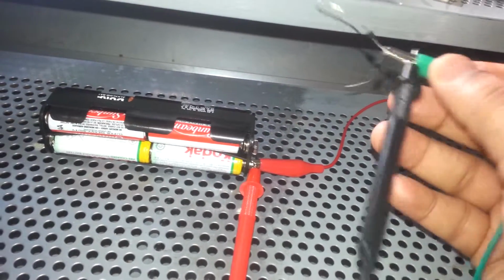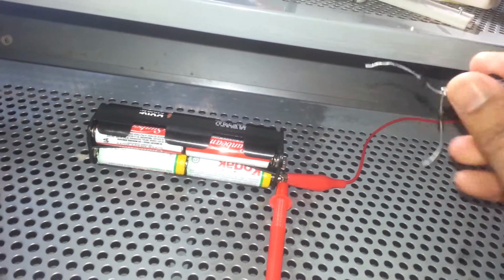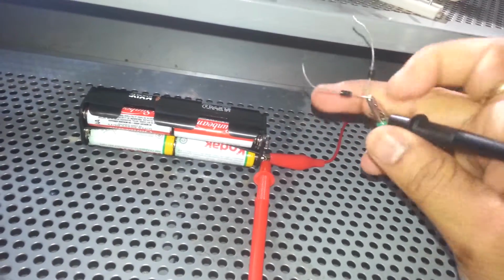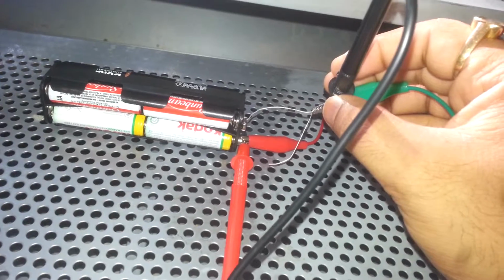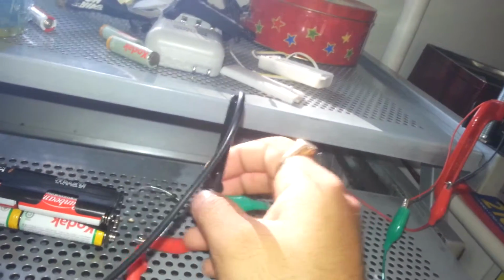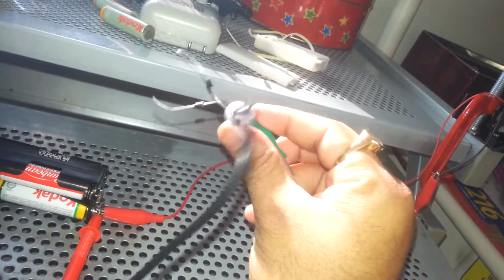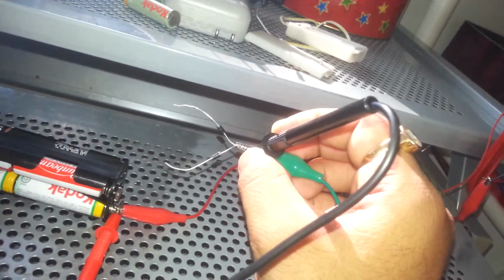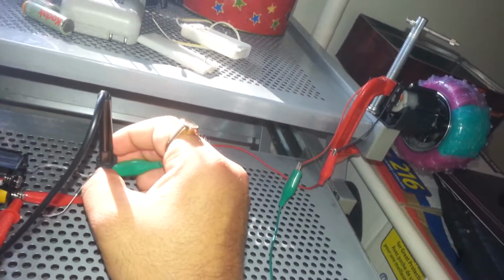So we did not use the charging current of the generator. Now I show you another variation: I run this with the discharging current from the battery, and then I short it with the other diode. And when I do so, it quickly uses the generated voltage and shorts it, which builds up a current inside the generator, and then the generator's motion gets opposed, and that is why it stops. So it is like a braking action.